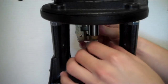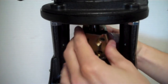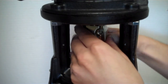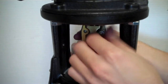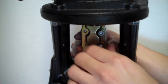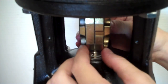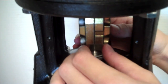Now we'll begin reconnecting the coupling. We'll set it so that the small hole in the middle of the coupling has the pump shaft pin sitting inside there. For now we'll just loosely put these bolts back into the coupling. As you can see there will be a gap between the two coupling halves. While tightening these bolts, try and make sure they're about even — work back and forth while tightening so that one side does not go closer than the other.